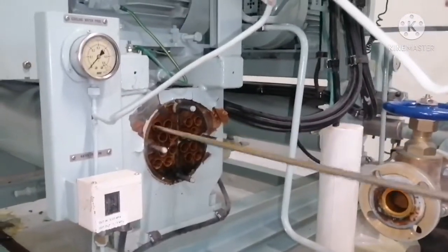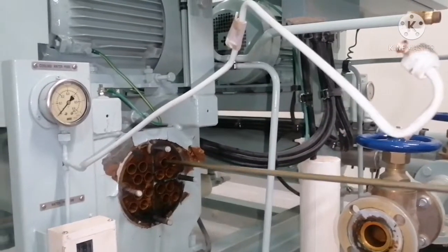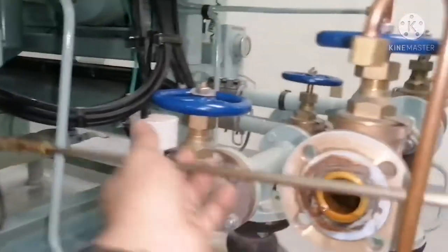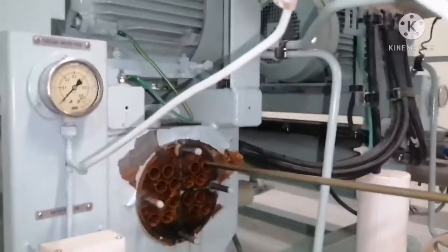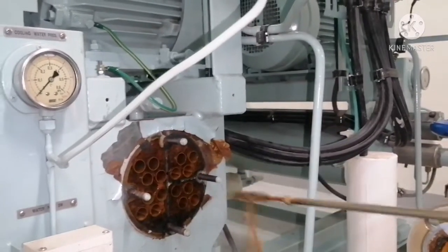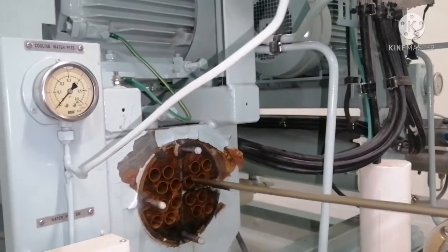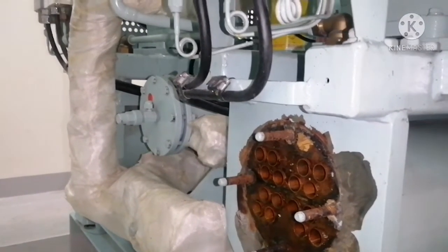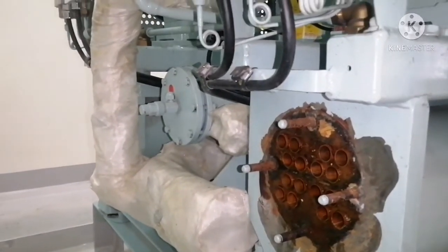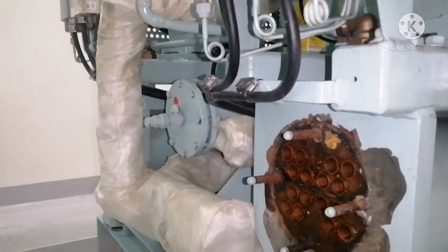This is how we do the cleaning for your cooler. You can see a cleaning brush kept here. This is your brush and you have to choose it according to the cooler tube size. To do the cleaning, just rinse out the cooler tubes. Usually the brushes will be copper brushed so that they don't damage your cooling tubes.